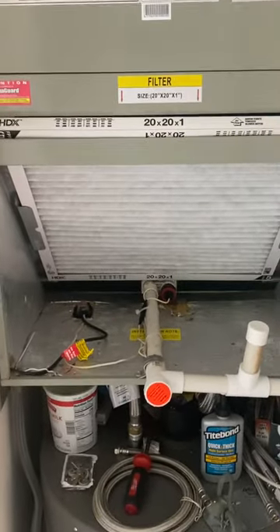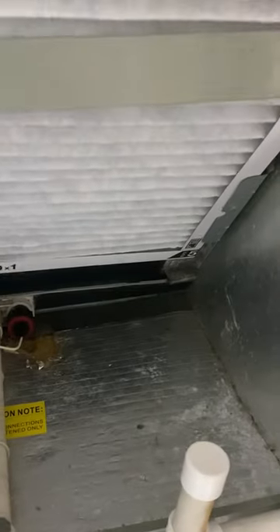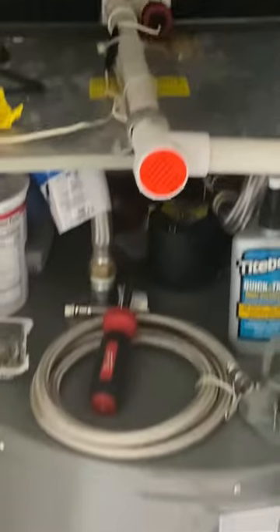It's a jelly, crazy-looking stuff. What happens over time is it builds up in the condensate drain tube and especially in the p-trap. If that plugs up, luckily most systems here have a safety switch that turns the AC off if water builds up. It actually happened a few years ago — the switch was so gummed up it didn't work and ended up dripping into the pan underneath the hot water tank.